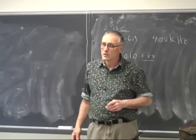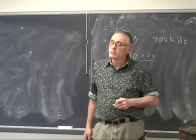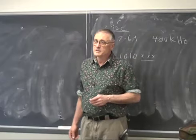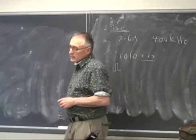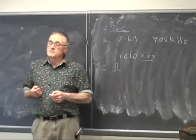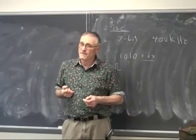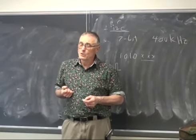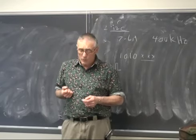Why do so many accelerometers use this? Well, it's cheap, and it's been growing in popularity probably because it's cheap, and it saves one wire, one pin over SPI. But you're saving information from being transferred too. Yes, that's true. It's slow. It's slow.